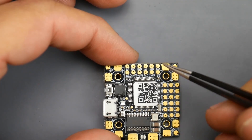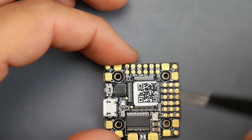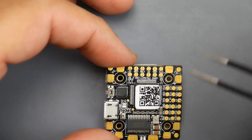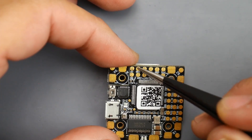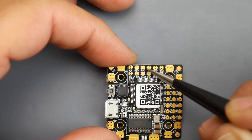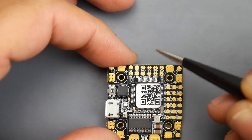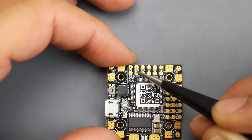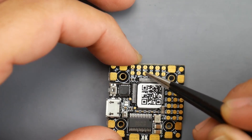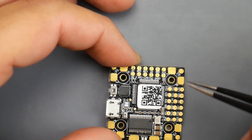Let's begin the connection setup, starting with the camera. The camera connection is straightforward — it goes up in the front. The red wire is 5-volts, the black wire is ground, and the yellow wire is CAM. We also have a cam control pad, so if your camera has an OSD wire you connect it right there and control it. You can also access battery voltage there if you need it for something else.